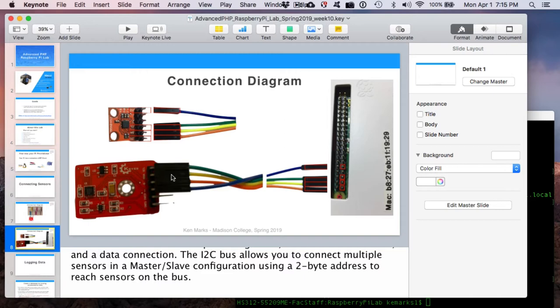These particular accelerometers I got from eBay for about $3 that came from China. And they're pretty much the same sensor that's in your smartphone. If you've ever played games where you're rotating your phone around or playing like a pinball game, that's how that works. Also, if you look closely on the back, you will see these two little tiny pads, and it probably says something like jumper one. There are blank pads on there. If you put a solder connection between those two, it'll change the address. So you could actually have more than one of these, one without the jumper and one with the jumper, and you can daisy chain them together on this single I squared C bus.